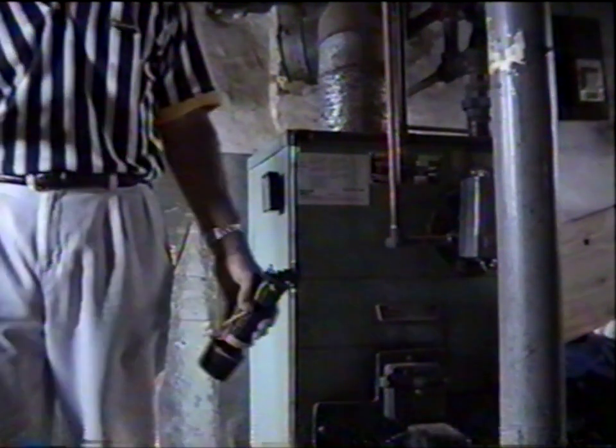It is. Yep. It's the water. That's your old pump, the old well. That's the disconnect box for the old well. There's no wire coming out. There's the wire feeding it. I would remove this wire right here. Yeah, it's not needed anymore. It basically comes in and attaches right here and right here, so it's not protected by a fuse. It's probably protected by the main, one of these mains here. This one right here probably disconnects power to that, but basically it jumps off of here, so the only circuit fuses protecting whatever you attach to that disconnect box are in it. It's not needed. You wouldn't really put anything on that, since it's an old well wire and disconnect box.